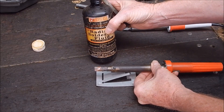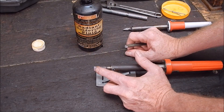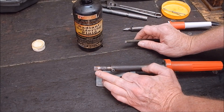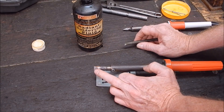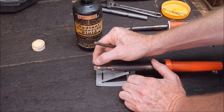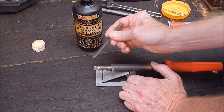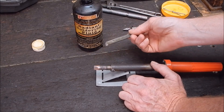If you're going to use wire solder, wind some around there to cover the area, then wet it with soldering solution — I use liquid soldering solution, though you can get paste. Just wet it all with that. Then plug your iron in and let it come up to temperature. Where people go wrong, even though they've cleaned up correctly, is they get their iron up to full operating temperature before they try and put the solder on. That's wrong — it will re-oxidise the nice clean surface before you get the solder on. So bring the iron up to temperature and as it comes up, the wire solder will just melt on beautifully. With stick solder, dip it in soldering solution and wipe it on as it's coming up to temperature until it starts to melt. Then let it go — it will basically tin itself and then go up to full operating temperature. Job done.